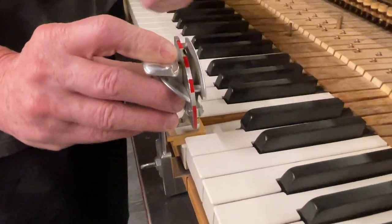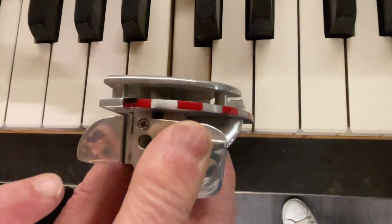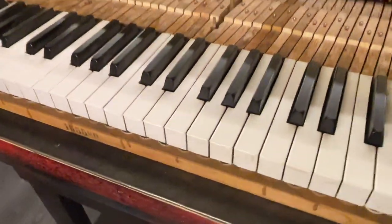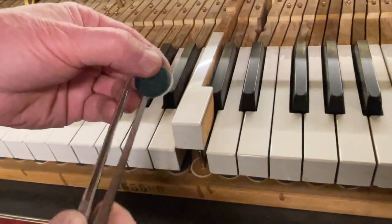You see the arrow comes right to the edge of my second red rectangle. Now I want to show you what happens if I add a punching. The ratio is one to seven, so if I put in a 0.4 millimeter punching, that means one to seven gives 2.8 millimeters — so my arrow has to move off my square approximately 2.8 to 3 millimeters. Let's see — I put a 0.4mm punching on this C key.